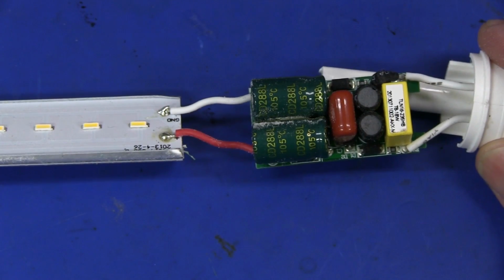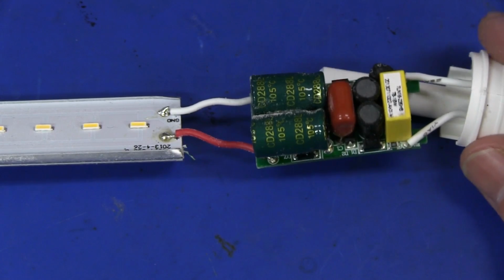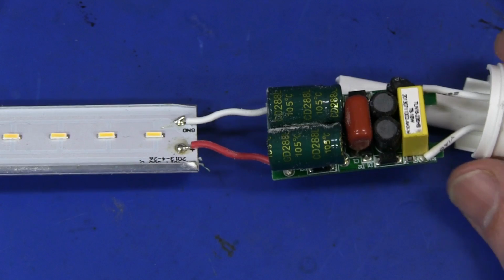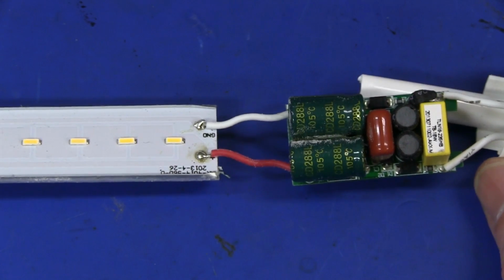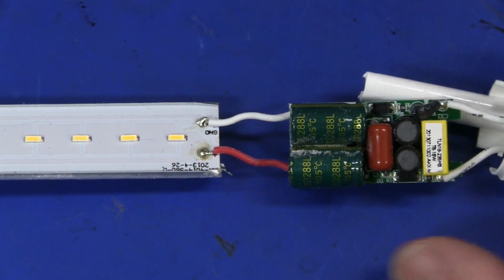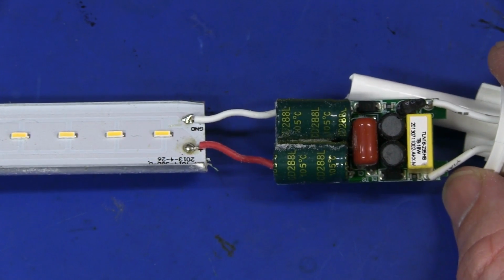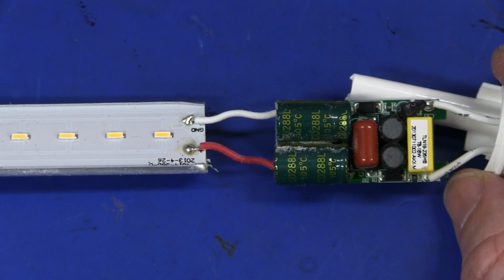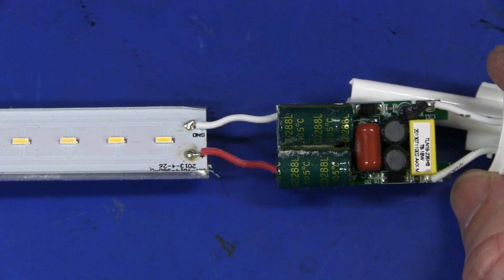So that's rather impressive, but I guess ultimately not hugely surprising, given that this isn't some hack manufacturer making these things on any production line. They're really going to optimize their production line for this large size board, because normally you can't get PCB panels this big. So, this is over 1 meter long PCB. So not every PCB manufacturer in the world is going to be able to A, manufacture that board for you, and then B, you have to find an assembler who can do a 1 meter long board.